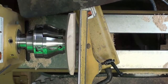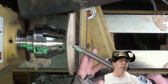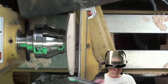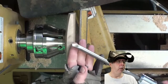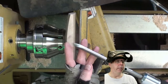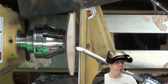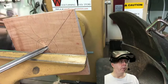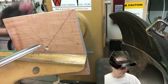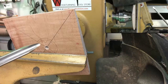So I'm going to switch gouges. This will have a nice sharp one. This is a Carter & Son 1/2 inch gouge. I was using the Thompson gouge. Full swept-back wing, 55 degrees thereabouts in the nose angle. Nice convexity on the curve. So it's my typical long sweep gouge. Got the tool rest set up, so it's going to cut right on center. And put that one up there.